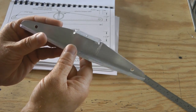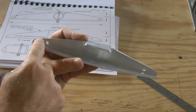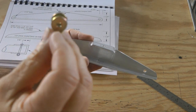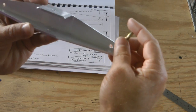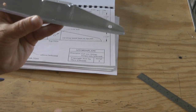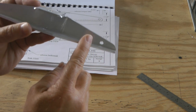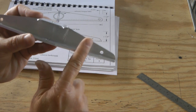Now here's the horn. I just removed it. The problem is that we need to connect cables to both ends. And the most common way to attach a cable is with a shackle like this one. It's got the holes in the middle. And if we use that to attach, we'll see that we run out of room down below. It was probably my fault — I made this a little too literally to the plans and not enough room was left. We could move it inboard, but then we're going to lose the throw because it rotates in the middle, and the closer we come in, the less movement up and down it goes.